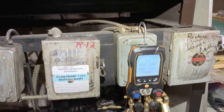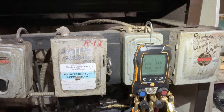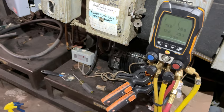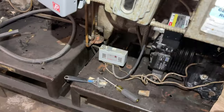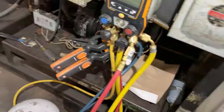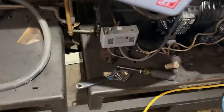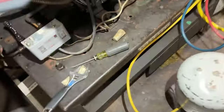I think that one TXV may not be feeding correctly. If that's the case, we'd have to get another TXV. I just went through the history — it looks like we've had a TXV head that was acting up not long ago. I lowered the cutout pressure and I'm waiting for things to clear up. We're down to 8 PSI. Let's go ahead and open it back up and see if that thing goes solid. The valve is so far apart it's hard to even see what's going on.